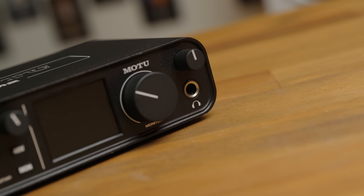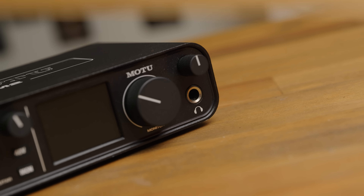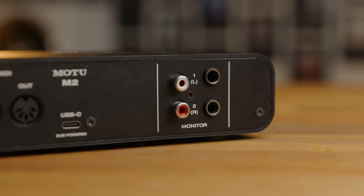On the far right there is also a headphone output with a separate volume control from the main rear outputs. Those rear outputs come in either single-ended RCA or balanced TRS, and whilst usually TRS jack connectors are the single-ended option for headphones with two channels, here where you've got one for each channel, it's no different from the three connections on a balanced XLR cable, so you can safely adapt these to a balanced input of an amp and it will actually be running balanced — it's just a different connection because XLR wouldn't fit on this device.